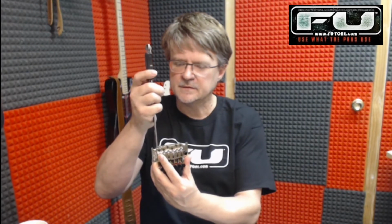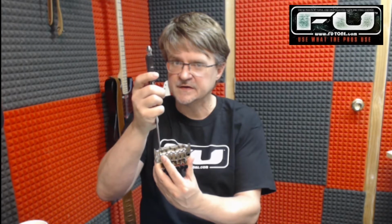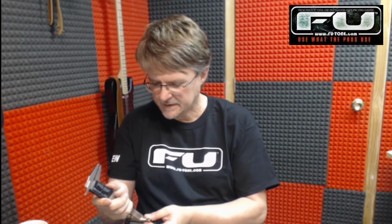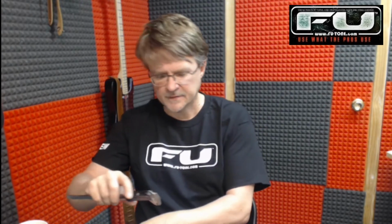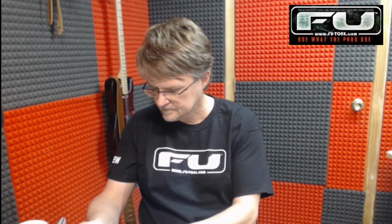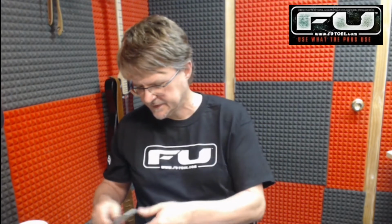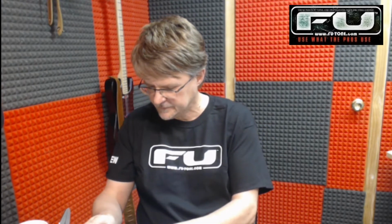What I will do is I go through and I'll write down on a sheet of paper from the base down to there, so that way I know exactly where that saddle is at. I'm going to take these measurements here really quick and write them down, because I'm not going to remember them, you know, who would. So we're looking at 3.77. You also write down which increment you're using on the calipers too. That will help once you start.